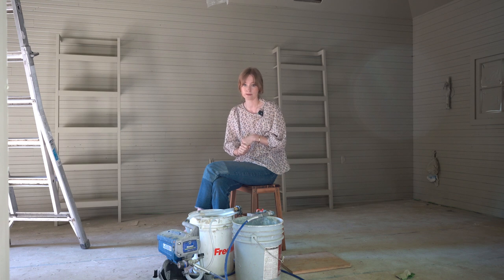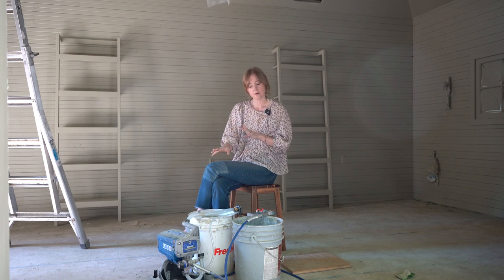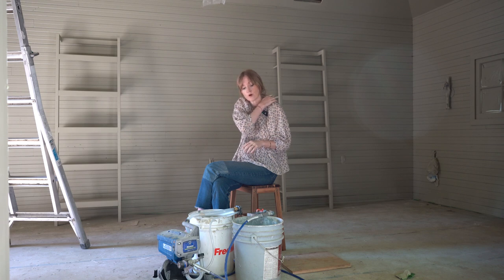I was a little abusive with the machine in that to do this room I needed to prime with an enamel-based primer, which is contentious whether you should send that through an airless sprayer like this. On the internet there's varying opinions. I decided to go for it because I had no other choice — I needed to prime this stained wood with an enamel-based primer because nothing else will keep the stains from seeping through. I'll walk you through those learnings as well as just the basics on how to get started, and then I'm going to start painting some cabinets so you can see how it works.